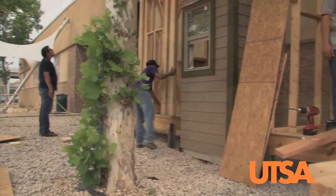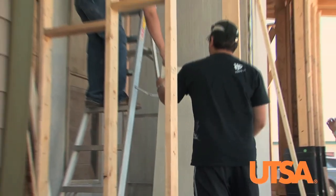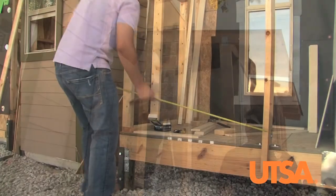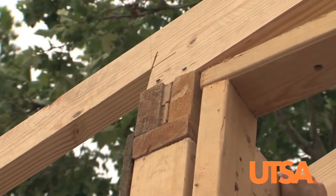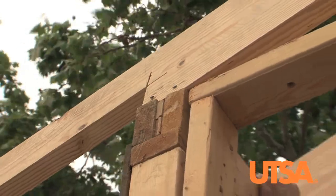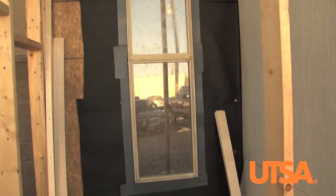Some of the issues have been actually building the actual mock-ups. I personally haven't had construction along with many other of the students, so framing it and keeping it square and true and having the materials overlap and make sure the waterproofing's there, make sure it's nailed in correctly, and while standing it up, also that one important issue is keeping it nice and square and true. Also, the way materials go together, the joining, not caulking is not always the best solution, so you have to overlap materials, just making sure that everything goes on correctly.